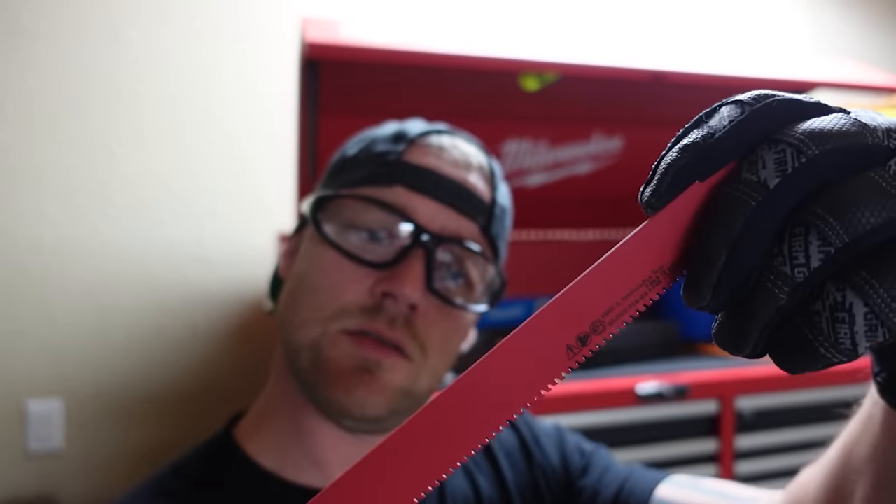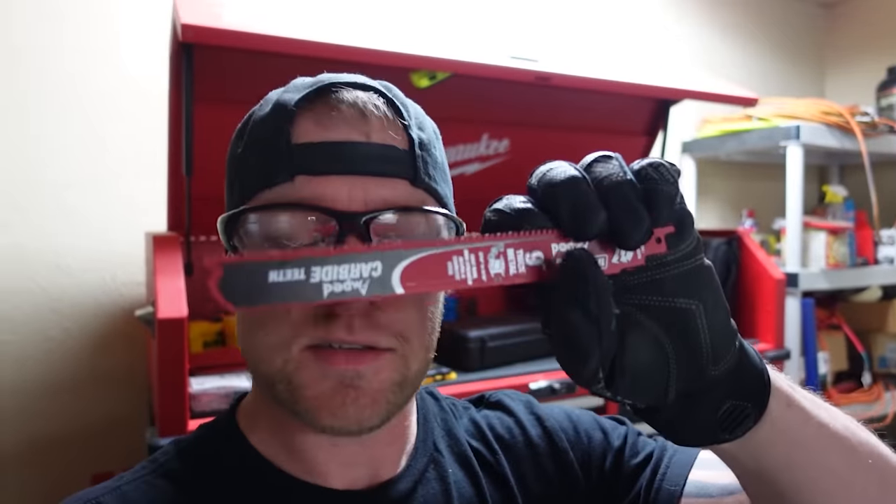It's nine inches, really meant for thick metal — about 3/16ths to 9/16ths, which is way thicker than necessary. I don't have a medium metal blade; medium metal is probably the best thing to use. Thin metal is a little too light for anything over 1/8 inch. As I'm cutting through this, it was really, really difficult to cut through — whatever alloy this steel is, it's really stout stuff.